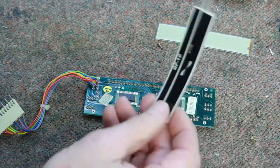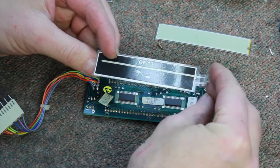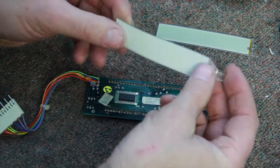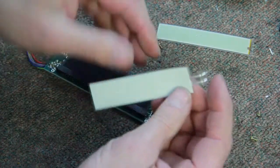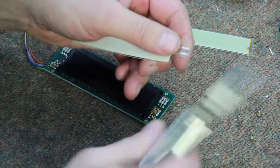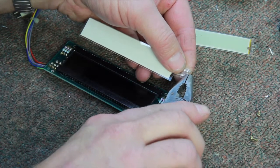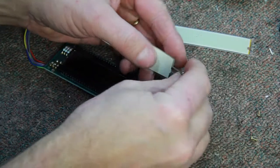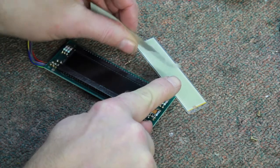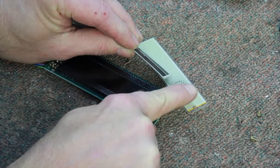Then grab your new one. The new ones I sell from Big D Broadcast Exchange at BigDMC.com — it will look like this with a flat layout. What you'll need to do is bend a little loop in it, and also bend 90 degrees as it's facing you. Bend a 90-degree angle like that — there's like a 90-degree right there, you can see it.